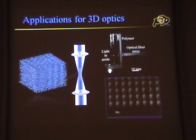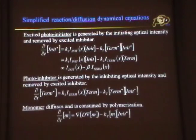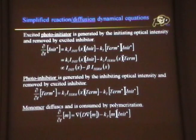Okay, so that was all traditional lithography. You convert, you solvent wash, you get rid of what you didn't convert. And there's a big crowd of people that care about that. I care a lot about these index features, like I've been showing you, data storage, etc. So could we take this same idea now and get into the three-dimensional control of index? And the answer is yes, in the same way we did it before. This is exactly the same stuff I had done before, but now I let monomer diffuse in some solid volume. See how easy chemistry is? We just add a term to the equation.